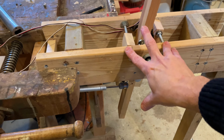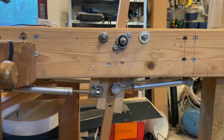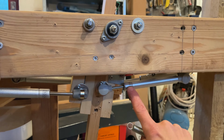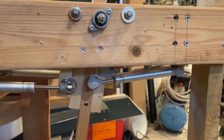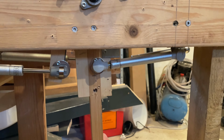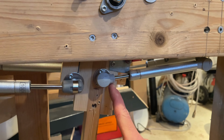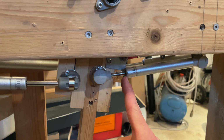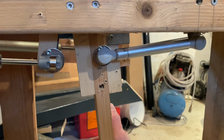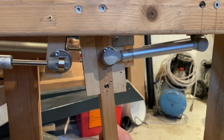mechanism is down here. And let me just show you what's going on down here. The very first thing I did was to mount some gas dampers. This one is 80 Newton, and the reason for the dampers was to give a bit of resistance when you move the yoke, so it didn't move that easy. Furthermore, when I pull the yoke backwards, you can see this part hits this part, which limits the travel of the yoke. So making the yoke stop at the right position is achieved by this not going any further. That's how I limited the travel of the yoke to those -4 degrees.